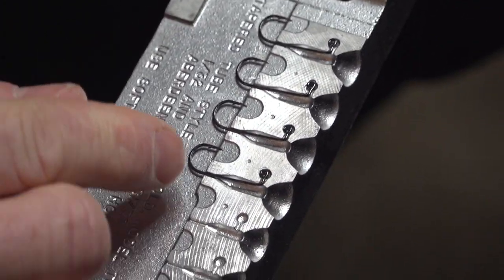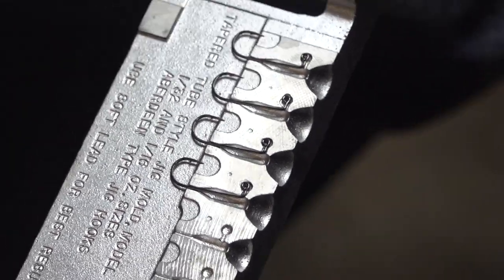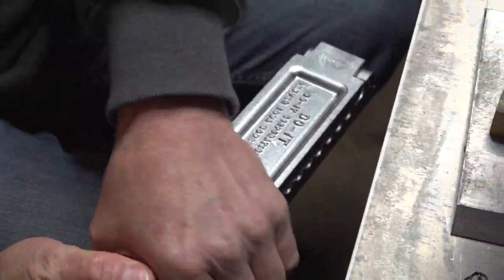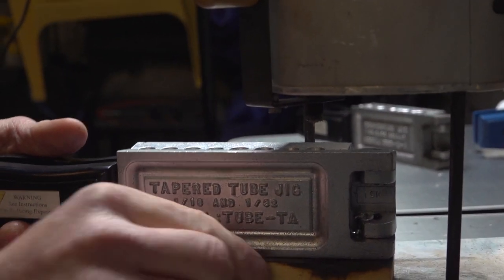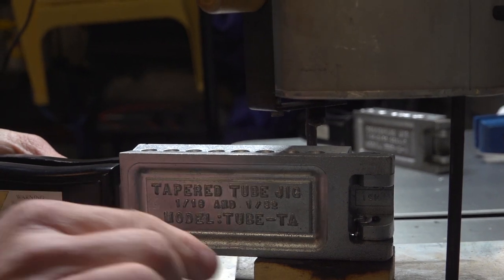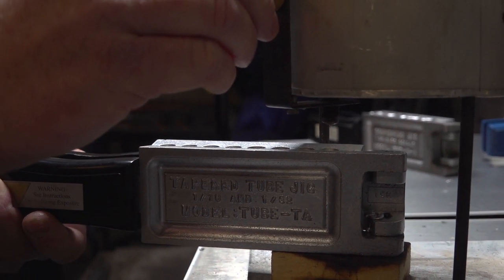You give them one look over, make sure the hooks are in the appropriate places, and then close the mold. The trick here is you just want a nice consistent pour. If you overfill it, it's no big deal. You just don't want to go slow, because that's where you'll have an incomplete pour.